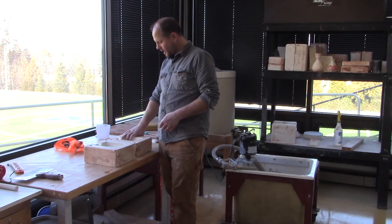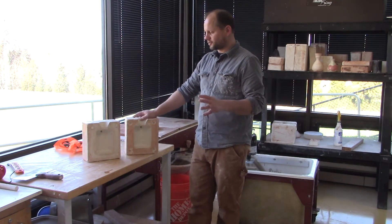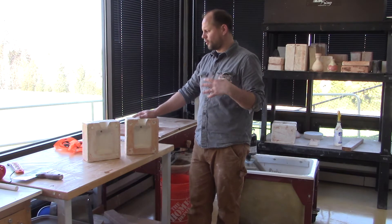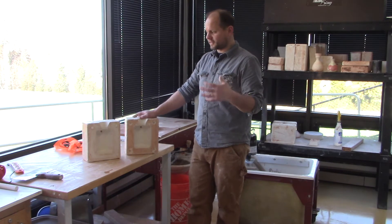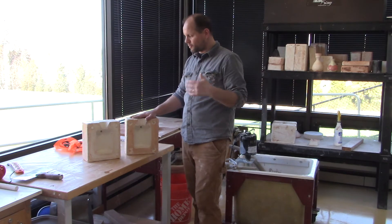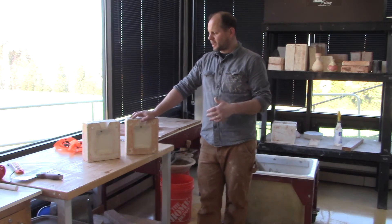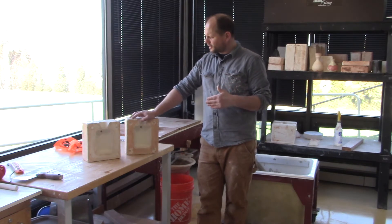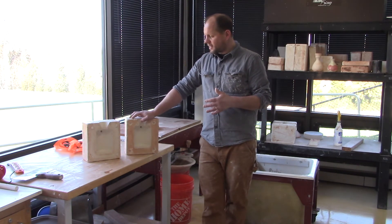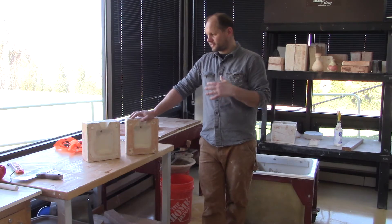Now I'm going to cast my mold. I'm going to cast one of the Oya projects. I haven't used this mold in a couple of months, so it's ultra dry — it's probably going to cast a lot faster. Once you start using your molds regularly, the cast times get more consistent. But as you use them throughout the day and over consecutive days, they will get saturated. The goal is to get as many casts out of them as you can in one day, then set them out to dry — maybe put a fan on them so they're really dried out by the next day.